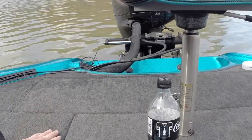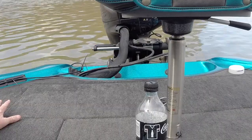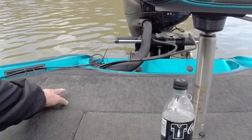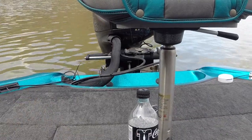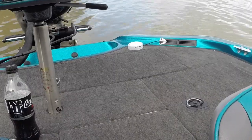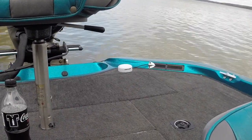Just like I would advise you to do, I went back to square one and tested every location. Every place tested fine with the compass until I cranked the motor up — sure enough, there was all kinds of interference. It must have something to do with the new charging system. The only place I could find on my boat was on the port side of the boat in the corner.